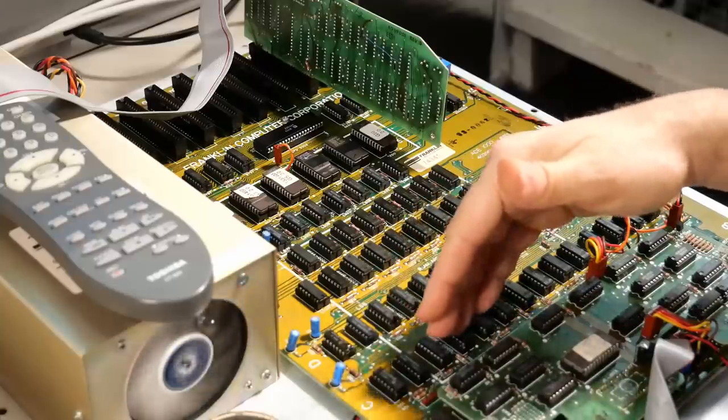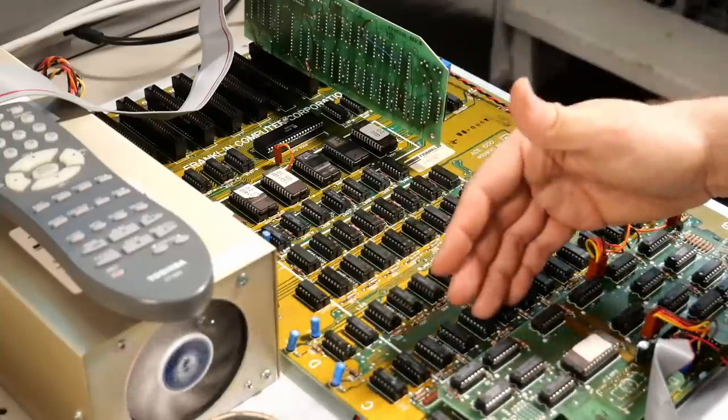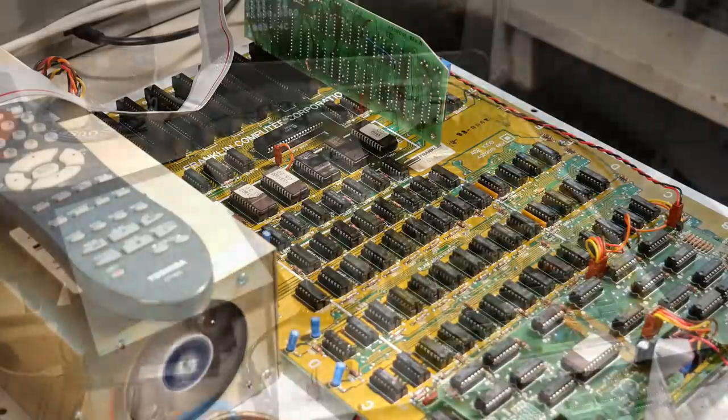That probably explains why I say BASIC works, because it's running within that first 4K of memory, but everything else I try to do boots up and takes up more than 4K of RAM and just immediately overwrites itself.